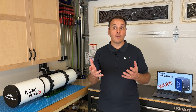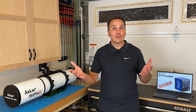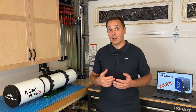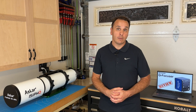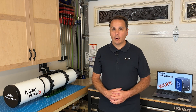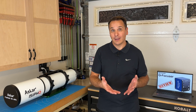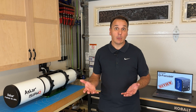Next, I realized that the focuser was not updating its position while moving. So if you move the focuser by a large number of steps — and it might take a minute to move to that new position — an application like NINA, which polls the driver every second, will keep showing the same position until the focuser has stopped moving. Only then will the position be updated. This is not a huge deal, but getting live feedback on the position of the focuser while it's moving is something I got used to with the EAF. And if you operate your gear remotely, I'm sure you like to receive that kind of feedback. If you check out my OG focuser, you'll see that it also supports querying the position while the focuser is moving. I had to structure the firmware code a certain way to enable that, but it certainly was not that complicated. That is something I would expect from QHY.